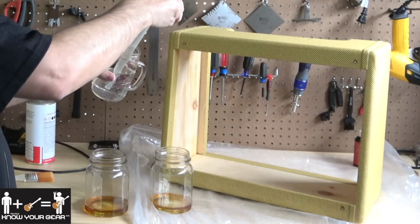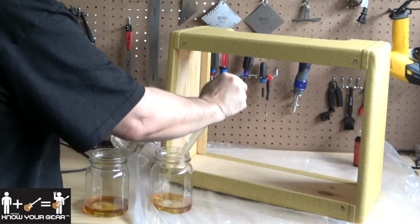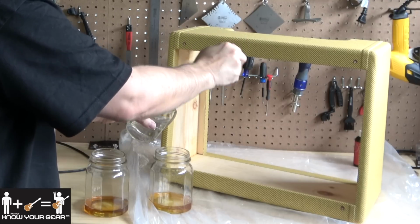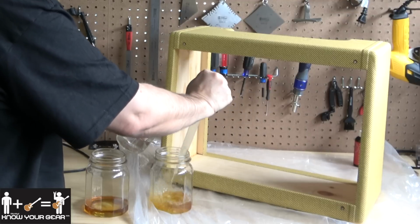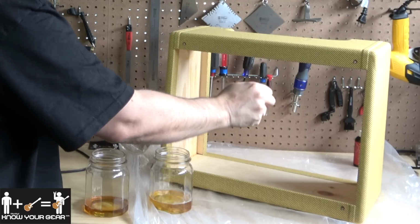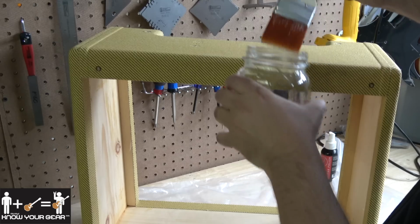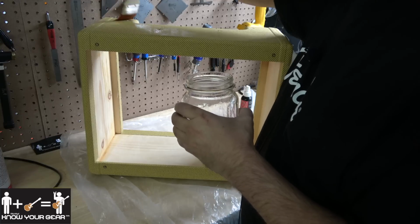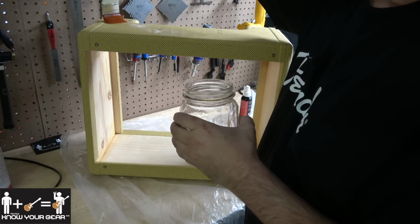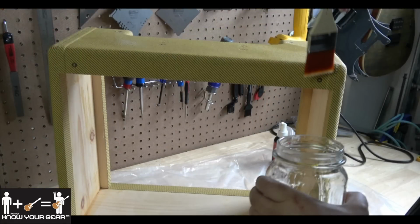And now I'm going to do 4 of the alcohol, and that's a 2-to-1 ratio, but I've seen it done 3-to-1 and I've had success both ways. I'll do 2-to-1, and if it looks good, I'll go with it, knowing that I can always add 1 or 2 more of the alcohol or even add some more of the shellac back in. We're going to go with the chords, which is basically like saying go with the grain. Nice even strokes, and be very aware of where you're starting and where you are, because again, it gets hard to see it. The cut or mix that I'm using can look or feel dry within 20 seconds.